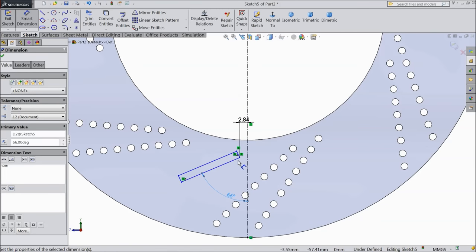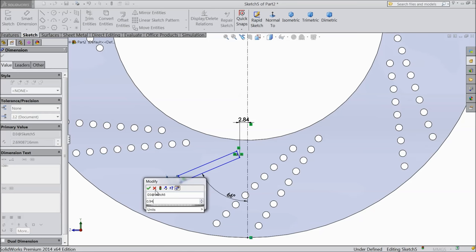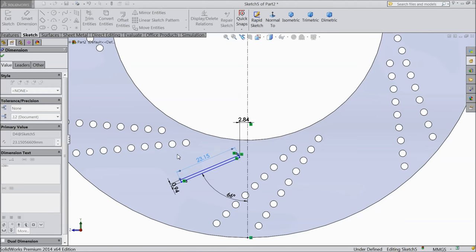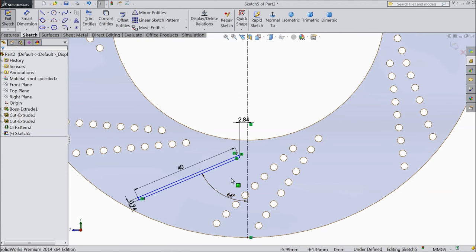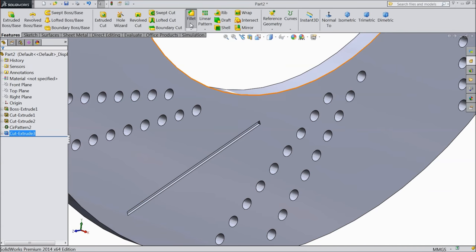keep the degree 66 and the gap 0.94 mm and the length keep 40 mm. Select OK. Now select extruded cut and depth only up to 0.6 mm. Okay. Now choose fillet